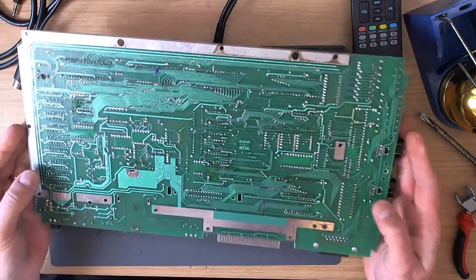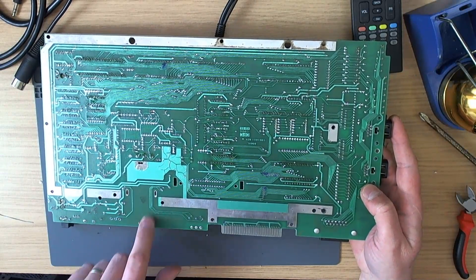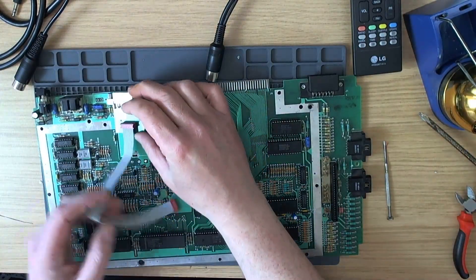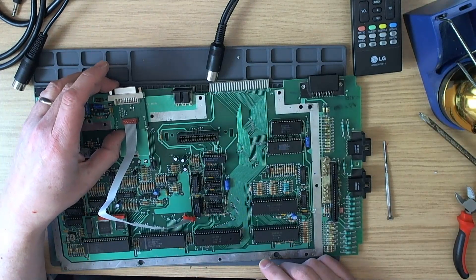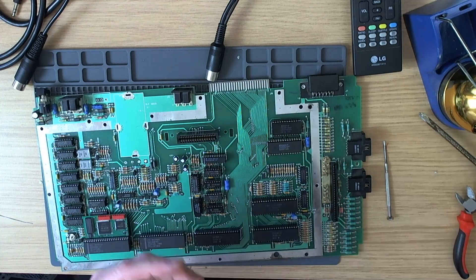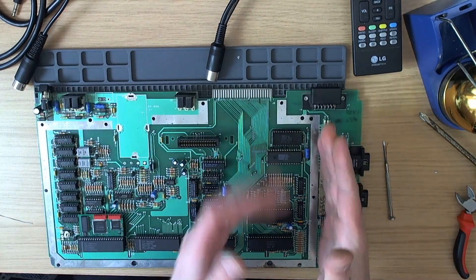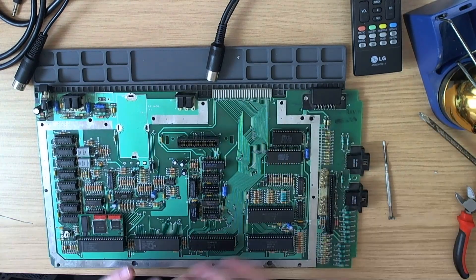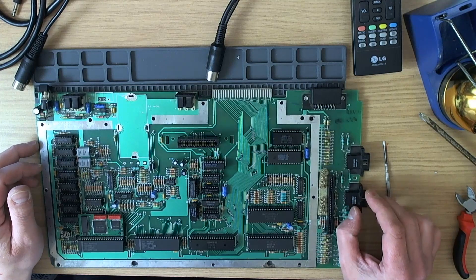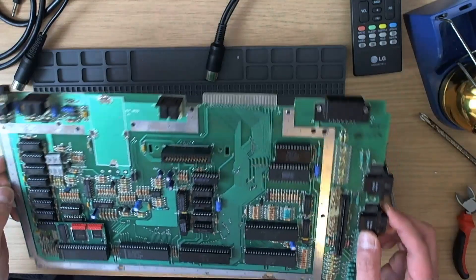This time I managed not to rip the plated-through hole out from the back of the board. The DVI adapter, using the little supply pins, will be quite easy to fit in position — the tricky part is cutting the hole in the back of the case. The Ultimate One Megabyte will go up in the top corner with nice short cables. Now that we've overcome this little problem, I'm confident this will be a happy build, and a happy 800XL that will sail back to its owner very shortly with no problems whatsoever.